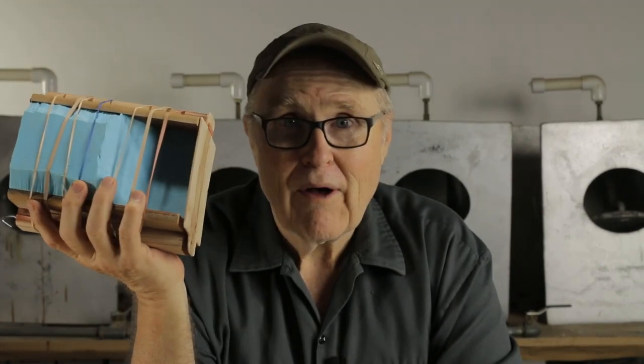So upshot is, this thing was cast with no tank, no pressure. So it's just a plain old gravity pour, nothing helping it debubbleize, so we're gonna see what we get. I thought, well, lemonade out of lemons. We'll just see what we get. This would be what you would get if you didn't have debubbleizing gear like vacuum or pressure.